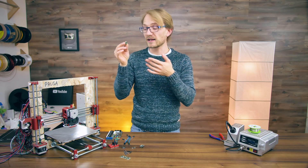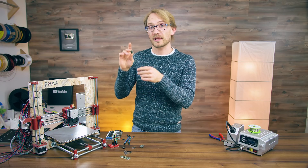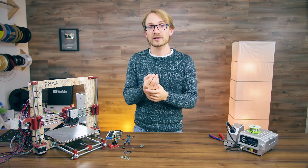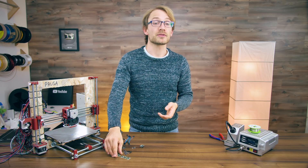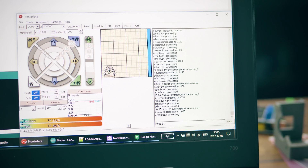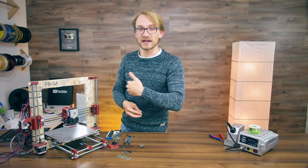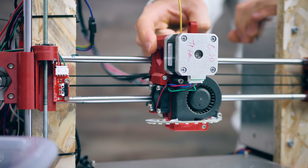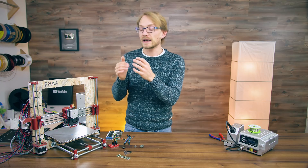That is the TMC2100, but what we'll be using today - and what the Prusa MK3 is using - is the TMC2130. It's the same basic chip and you're getting all the advantages of that, but on top of the TMC2100, the 2130 adds a communication interface that hooks up to your controller. This allows the stepper driver to report things like whether it thinks the motor it's driving is about to lose a step, and it lets the controller set motor current and manage many details about how it drives the motor. Your printer's firmware can autotune how much current your motors need to run as cool and quietly as possible without losing steps, so no more fiddling around with those tiny potentiometers. It also means you don't need end stops for the X and Y axes - you can just ram the axis into one end and the driver will sense the resistance once it touches the end.